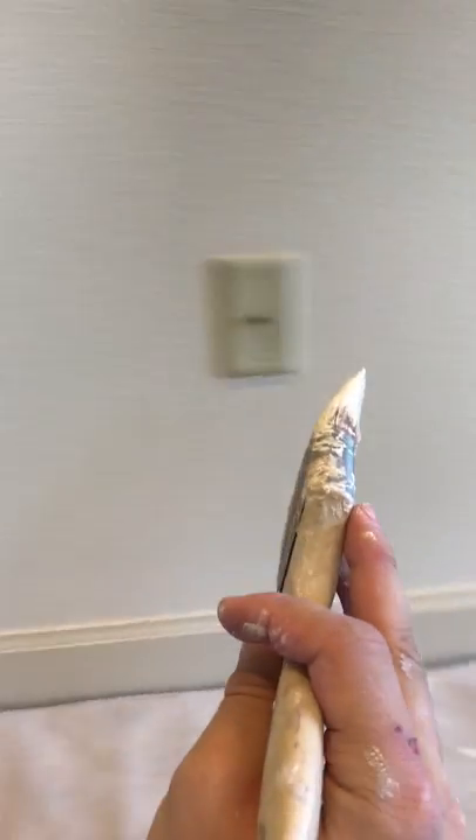Same thing. So now we've got this whole wall cut in a few inches up to here. And when you run into these — we got up that door and right down here cut in so far — when you run into these guys, you're gonna do a lot of paint around here. Basically when I get done, all this will have paint around it, cut all the way down to the bottom. All this I paint around, so my rolling man whenever he's rolling can just go straight around these and continue on.